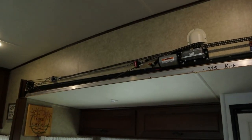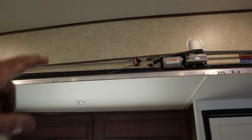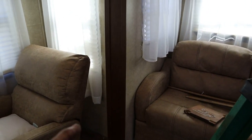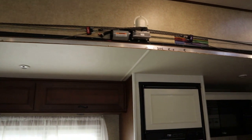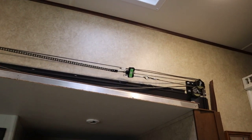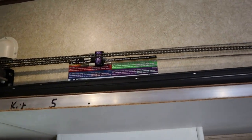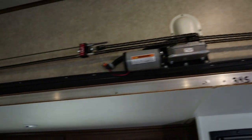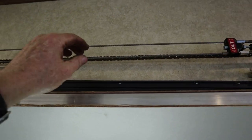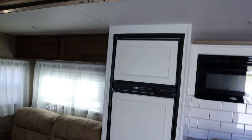Okay, and all we're doing is, you have to remember that there's 8 cables. If you need to adjust the bottom out, the bottom end cable needs to be loose so you've got room to adjust it. This will mess with your brain a little bit if you let it. But we're going to carry on here. Yeah, we've made all the adjustments just like BAL wants them. The cables seem to all be tensioned about the same. Do the squeeze test. Everything seems good.